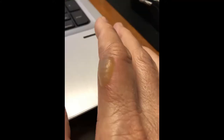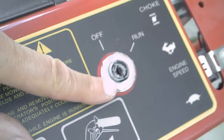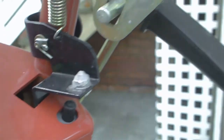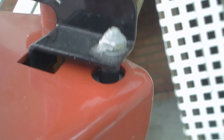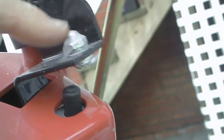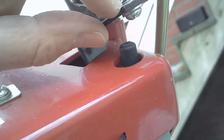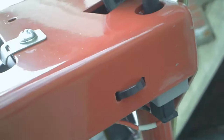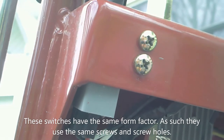When you're working with electricity, wear protective gloves and be careful. Control panel, voltmeter — this is the original switch. I still use that. These switches here I had to add — these are the attendant switches. When depressed, the mower starts, and once let go, the mower will automatically shut off. I put in some screws here — I'm not crazy about this solution but it works. I needed more depth and that's what I got, so it activates my switch because these are not the original switches.